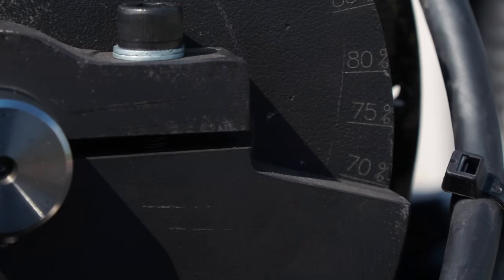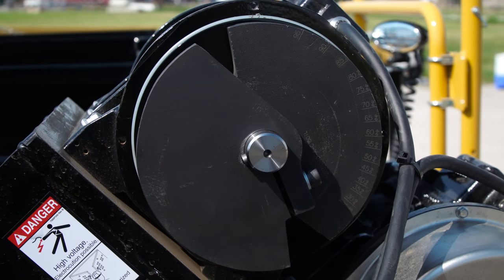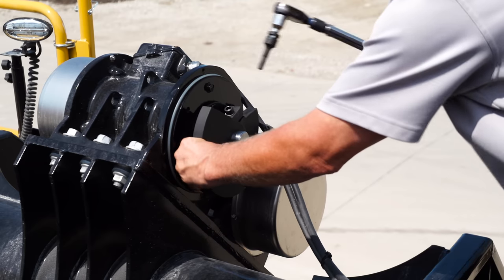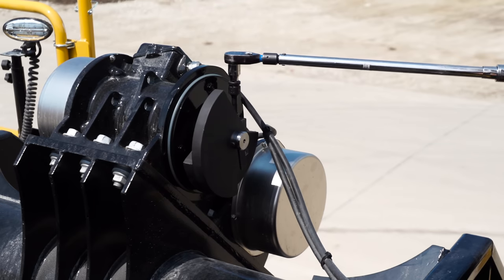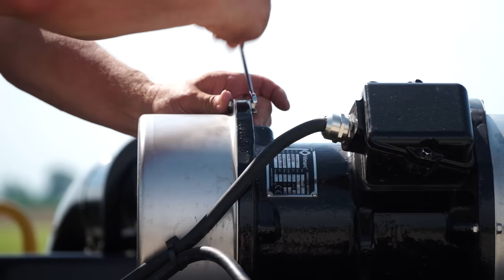The minimum operating weight setting is 70%, but can be adjusted up to 100% to help optimize shaker performance. When weights are fully overlapped, the percentage is 100%, and when the weights are not overlapped and totally opposite to each other, the percentage is zero. To adjust the weight setting, loosen the allen head bolt on the counterweight with the ruler and rotate the counterweight to the desired setting. Always make sure you re-tighten the allen head bolt to the proper torque specified in the manual. On this unit, it is 37 foot-pounds. Always set both sets of weights on the motors to the same setting. Replace the motor end caps and secure in place with the four retaining nuts and bolts.